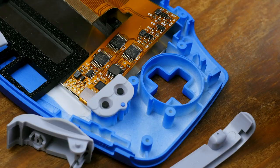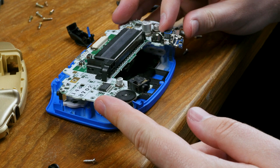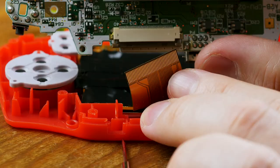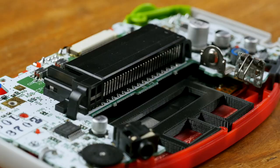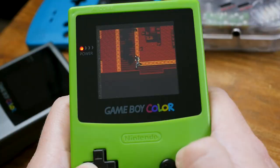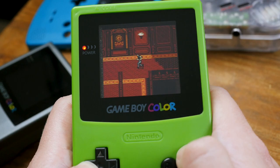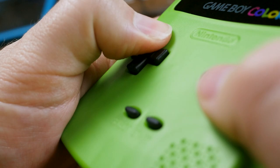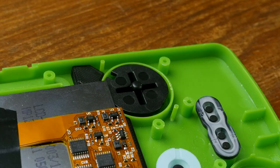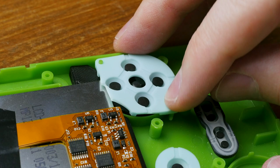With my Funny Playing Game Boy Advance, I used a reproduction front half of the shell, original D-pad, face buttons and membranes, reproduction R&L buttons, and an original back shell — of the ones I built, this one feels the best by far. The second GBA with the unbranded IPS screen feels less good, as the entire shell and all buttons are repros. My Game Boy Color used a reproduction shell, reproduction buttons, and original membranes, and feels good in most regards, but the up on the D-pad is very crunchy and inconsistent — probably because you have to cut into the D-pad pivot area as well as the D-pad membrane to fit around the oversized LCD screen.